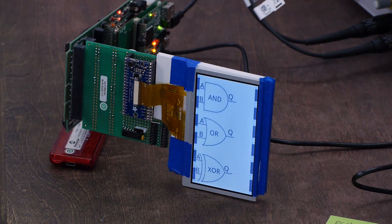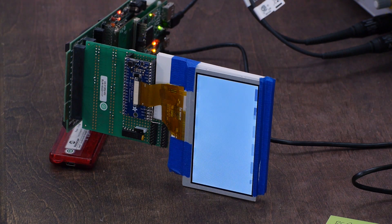To recap what we did: we used the PIC32MZ dev kit and were able to use a low cost controllerless driver to drive an LCD using interrupt-driven direct memory access data transfers — pretty cool. We got the PIC32MZ to display custom graphics. I still need to read up on how this library works, but this is good news for our project. We managed to get a Microchip PIC32MZ series microcontroller to drive an LCD without any additional hardware. Once you know what to do, it's straightforward — it's learning how it all works that's the hard part, with all those libraries. If you have any comments or questions about our Logic Gate board game build, remember to check out the subspace on the Element 14 community at element14.com/tbhs. You can also go there to read about other upcoming episodes, builds, and special events. We'll see you next time.